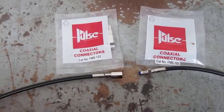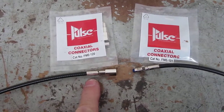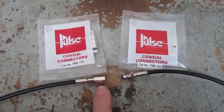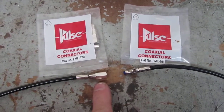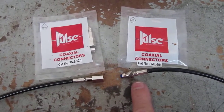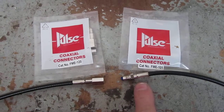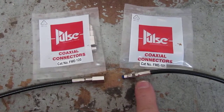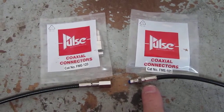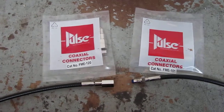When you do crimp them up, not only crimp the outside but also crimp the center pin. The center pin must be connected — crimped or soldered. Same with this connector here: crimp the outer, which you can see in the video, but the center pin must be terminated. Either crimp it or solder it. I prefer to crimp it because it's a lot quicker and much more reliable. If you don't crimp the center pins, you're on a hiding to nothing.